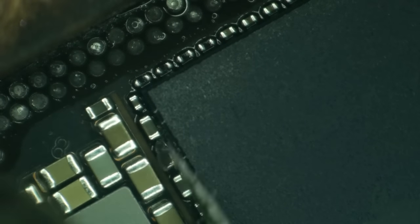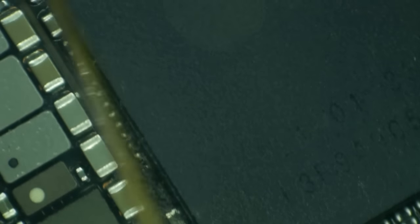So on the donor board, whenever I prep these boards, I trim around a lot of the surrounding components to try to give me less chances of having things that are gonna swell. But on the customer's board, I don't pay much attention to that. Like I'll often use some of their components that are around this CPU to fix my donor board, because sometimes I've knocked some loose, but other than that, we don't have to make this board to where it'll work. It'll be fine just like it is.